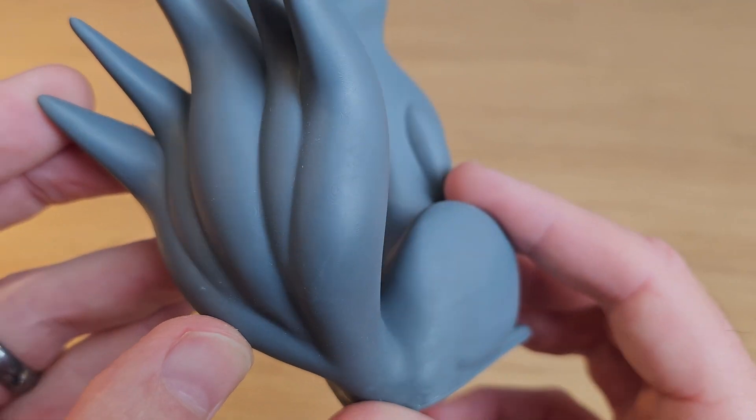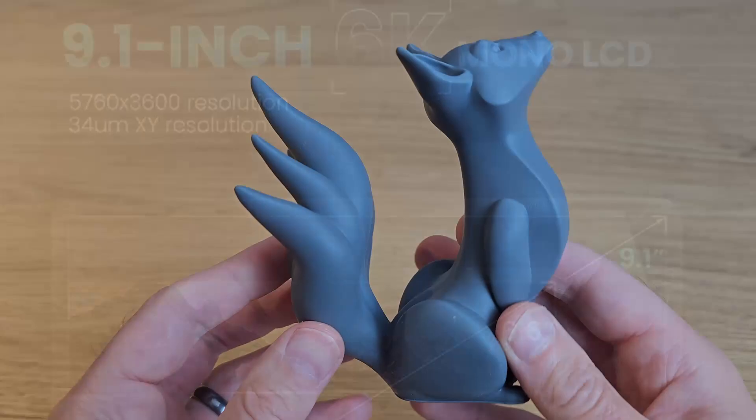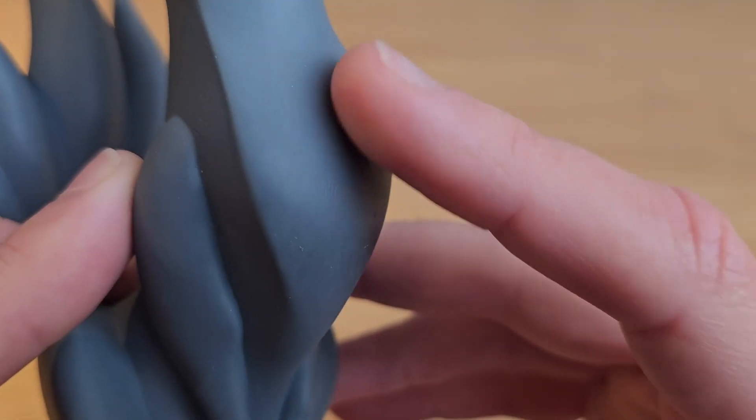The quality is very hard to fault, but if we look really closely it's possible to see some slight ringing on vertical surfaces. What we're seeing here is a direct result of pixel size — the Elegoo Mars 4 Max has a pixel size of 34 microns. If you wanted smoother surfaces than this, you'd need a printer with a higher resolution giving smaller pixel sizes. Some resin 3D printers have a pixel size as small as 18 microns, but the general consensus is that we can't really see any difference once you get below about 35 microns, so the Mars 4 Max could be right on the money. There are some slicer tricks you can do to smooth things out a little, but the quality is excellent — this ringing is really difficult to show on camera and I can't feel it at all.